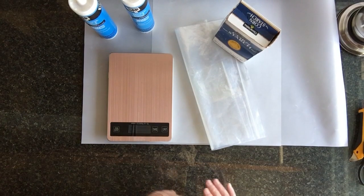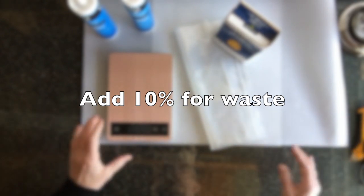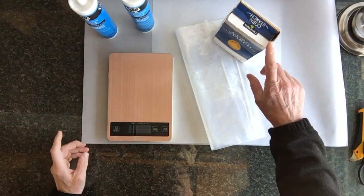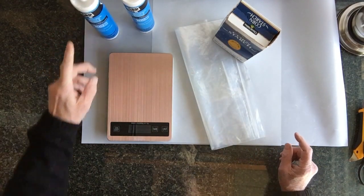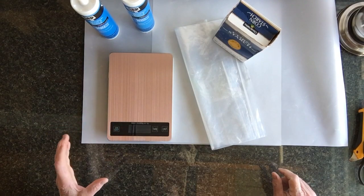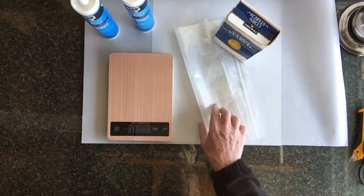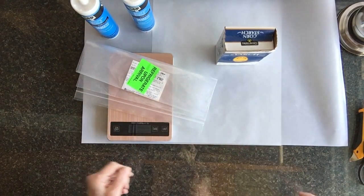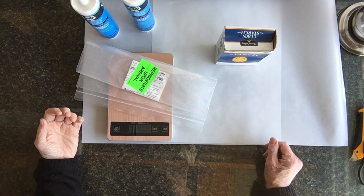I'm going to supply a calculation in the description for how to fill a volume, but we're going to move on and weigh the silicone and the cornstarch so that we have — for 100 grams of silicone — 10 grams of cornstarch. We're going to need this because we're going to pour a little bit thick in the back, and we need the cornstarch to help cure it. Let's grab the zip-lock, squeeze the silicone out into the bag by weight, add the cornstarch, and then add the mineral spirits by eye.